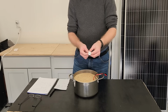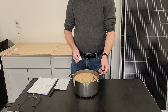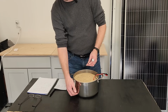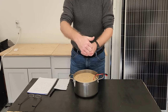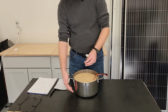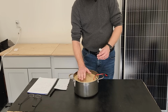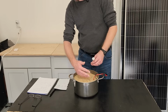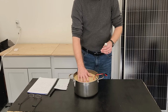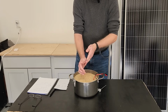This is a meat cooking thermometer, which taps out at 220 degrees. And when I applied 60 volts at 4 amps to this module, the bottom of the bucket of sand got so hot that this needle wrapped around like a clock in fast forward. So that's greater than 300 degrees. At that point, the surface temperature was about 110 degrees Fahrenheit. So this whole thing was well over 100 down to 300 towards the bottom. And it held that heat for about 4 hours. So this whole thing was radiating 100 some odd degrees for about 4 hours.